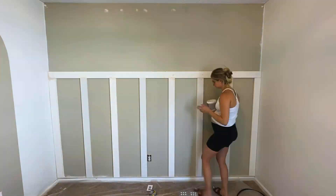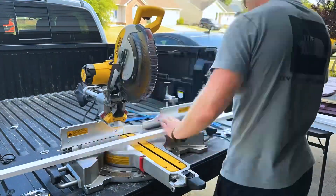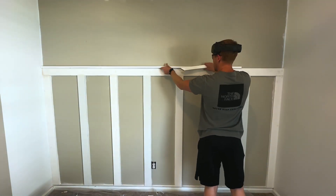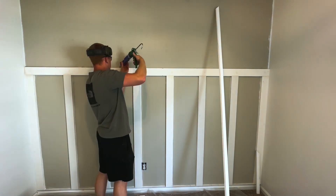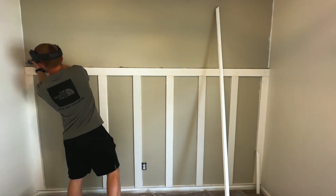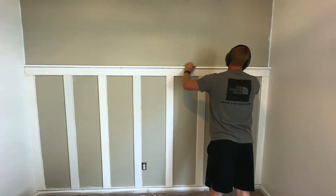Starting to come together here. Came back, used some wood filler, filled all of our nail holes, then used some caulk against all the boards between the board and the wall to make it seem seamless. Hint here - get a dripless caulk gun. I got a cheap one and all it does is piss me off every time I use it. We wanted a little extra for this wall, so we got a 1x2 piece and we're just going to stick it right on top of that board and batten.